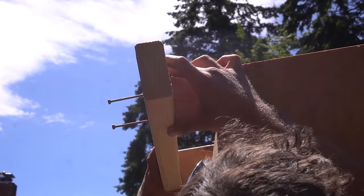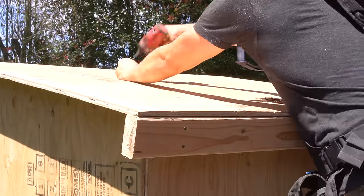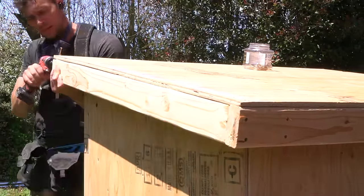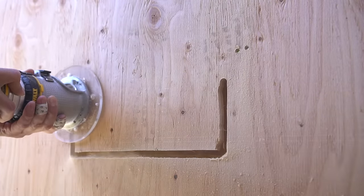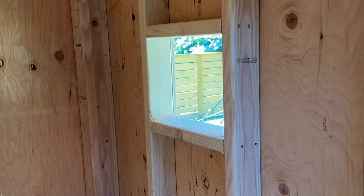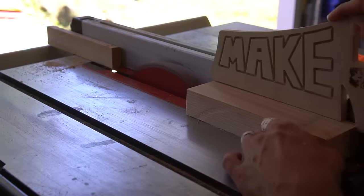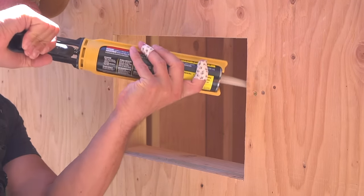I want the roof line to extend past the front and back slightly, so I secure another 2x4 on both sides of our roof, and that way I'm able to install roof sheathing and 2x4s on both ends. In order to cut perfect openings for our windows, I pre-drill one hole and then go back and use my router with a flush trim bit to cut out a perfect hole that's flush with our framing. In order to provide a nice clean and cohesive look for our windows, I did some framing — I grabbed a couple scrap pieces of 2x4, ran them through the table saw to have a nice one-inch thick piece, and then used that as the framework for our window.